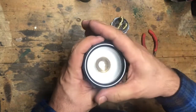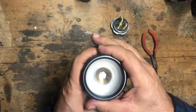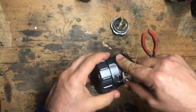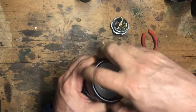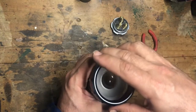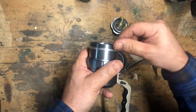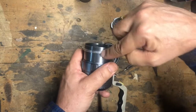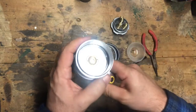On the front end, the business end, there's a lens. I've done the teeth test on that — it's plastic, but it does a good job of focusing the beam. It is zoomable and it zooms really well — quite smooth. The locking ring comes off as you would expect. Interestingly, talking about the different versions made with interchangeable parts: if you take this off, you can see that this has clearly been made with an original thread size that doesn't match the locking ring thread. So they've put an adapter that just screws on to adapt between the two different thread sizes.